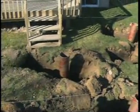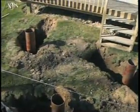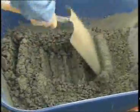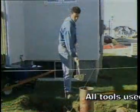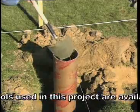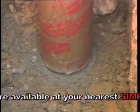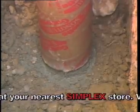Position the fiberboard tube form in each hole. Using the strings as a guide, make sure the forms are both level and centered. Pour the concrete in the tube in layers of 12 to 15 inches. After the second layer, gently lift the tube to create a base on the course of the foundation.